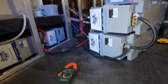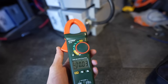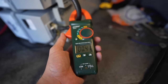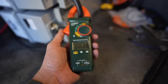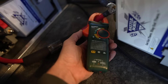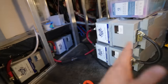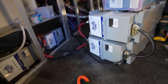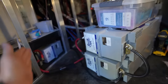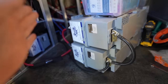If you don't do this, once you hook them up in series they're not going to balance to each other. When we started, this one had about a four-and-a-half amp draw coming out of it — you can see it's down to about 0.4. There was about a two-amp draw out of this one and it's pretty much down to nothing now. We left these on most of the day yesterday and all overnight, and that allowed these cells to all balance each other so that I can get the batteries placed.